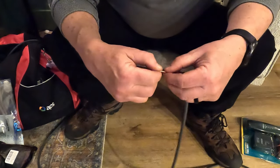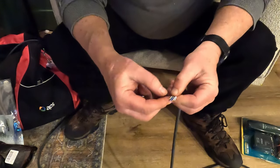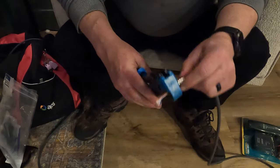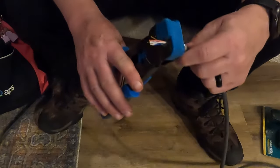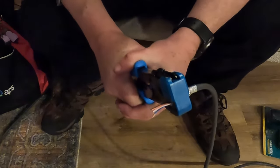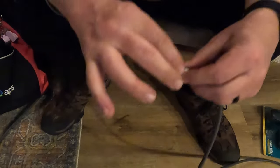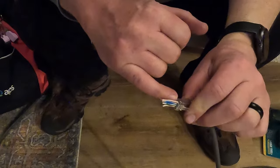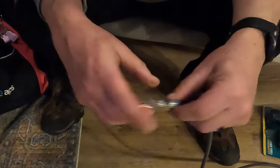The hint: the warmer these cables are, the more pliable they will be. It's a little chilly because it's still winter here. So with the end crimping tool, give it a good squeeze. Your ends are all nice and tight, squoze together, everything's good. Then we'll just cut those wires off, remove the excess shielding around there, and do the same thing for the other end of the cable.